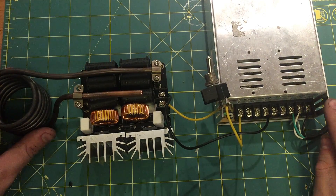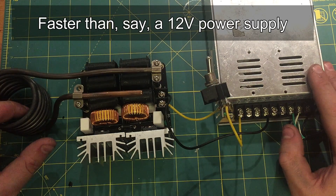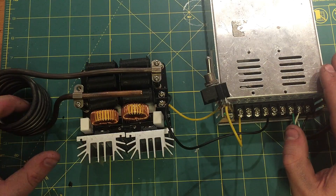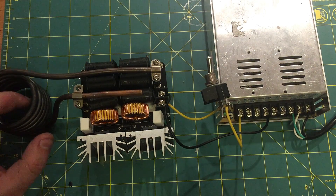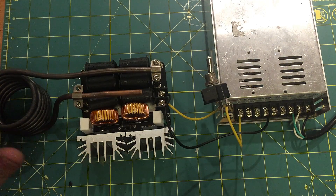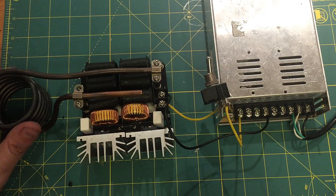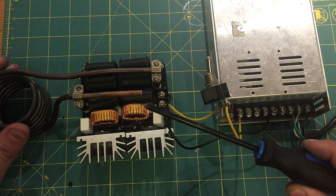I used a 48 volt power supply because it actually heats things up a lot faster. This is because the higher the voltage, the faster the current can stabilize in the coil, and the current determines how hot it will get. Induction heaters work basically by creating a magnetic field inside the coil. It switches back and forth so much it creates what are called eddy currents, which are a source of inefficiency in most systems. In this you want the eddy current, because the eddy current actually makes conductive materials get very hot. So this could heat up a piece of steel — say this screwdriver — probably in a couple of seconds.